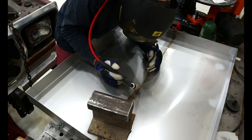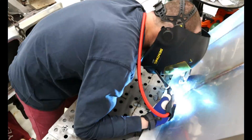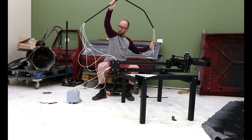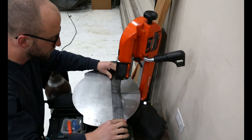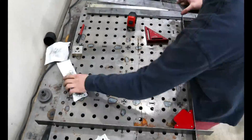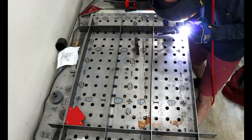As I waited for my new pan to come in, I focused on finishing up the wiring. I ran the wires through the conduit pole and started crimping on pins, pushing them into connectors, and finally plugging them in. Unfortunately I was in the 'this project is taking too long, let's just get it done' stage and did not film it. After all was wired, I started working on the bed plate — or the material that the metal actually rests on. This is the only thing I did not see documented in the JD's Garage plans. I ended up grabbing some eighth-inch by two-inch flat bar stock, cut some grooves which allowed each piece to nest into each other, and tacked them together.